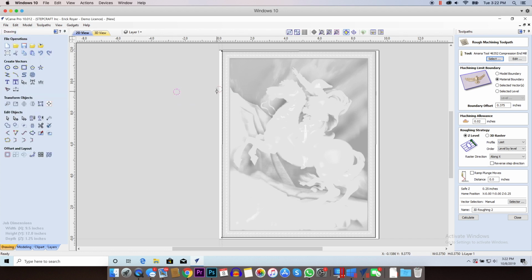And what I want to do, since this is my roughing end mill, and the white edge here represents my material, I want to make sure that when my end mill moves across, I'm actually clearing the edge of my material and bringing the end mill out here. It may take a few more seconds to machine, but it avoids having a really thin line along the edge that's not cut. And that way, when I come in with my ball nose, I know I've got at least a 3/8 of an inch clearance all the way around.